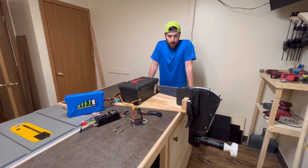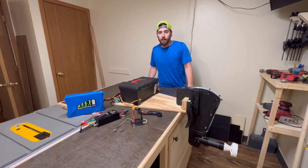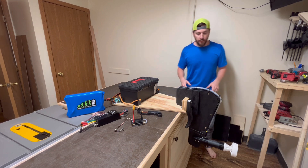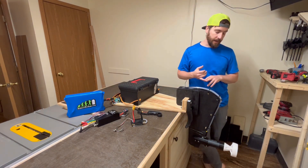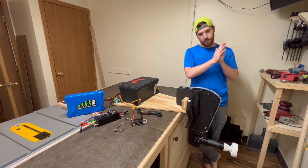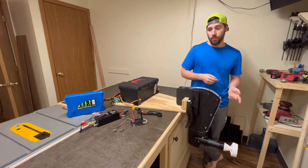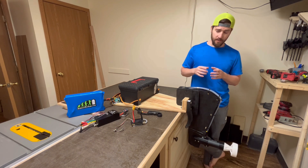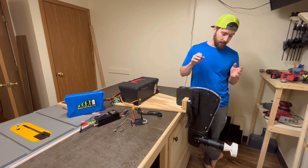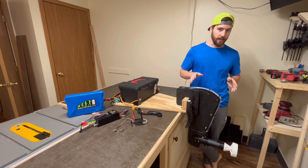Alright, and we're back. Let's talk about some of the technical information of what happened in the lake and then what I'm going to do to improve the power of this whole setup. First off, this motor is rated for 100 amps at 90 volts, which gives us the 9,000-watt rating — you multiply amps times volts, you get watts, and that's your power. As you saw in the video with the monitor, we're running about 20 volts with about 50 amps. Do the math — that's only 1,000 watts of the 9,000-watt potential, so really not hitting our goal there.